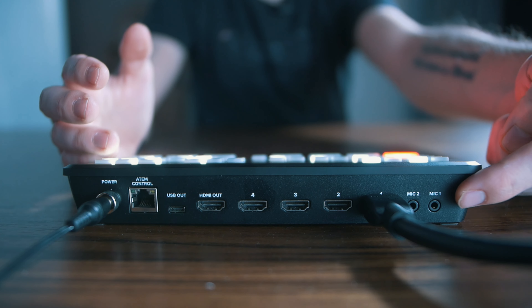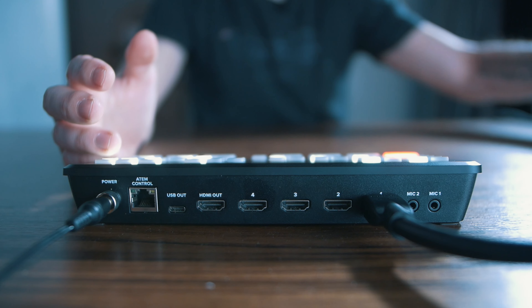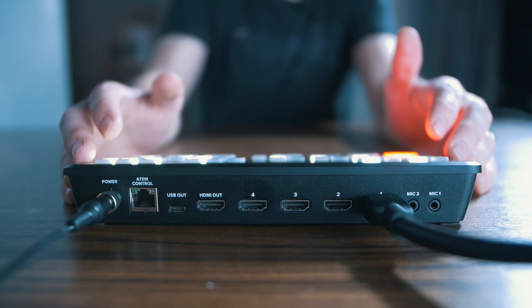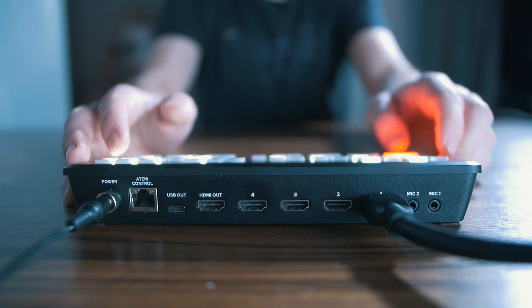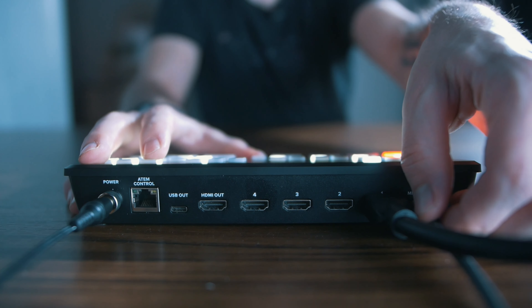You can see we've got a couple of audio ports right here labeled Mic 1 and Mic 2. For the purposes of this, I'm going to assume that you already have a soundboard in your church that works, so we're just going to take an output from that and run it into your switcher. Basically, we just need a mix — whether the one in the house or a separate mix box — and an output to run over here and convert into a headphone jack. So we'll go ahead and plug it in right over here into Mic 1.